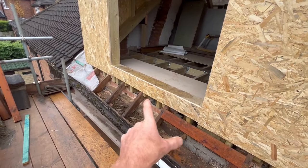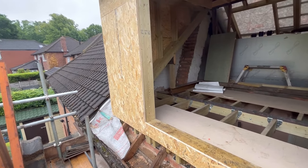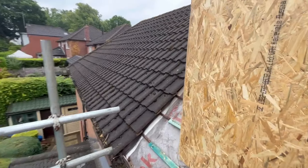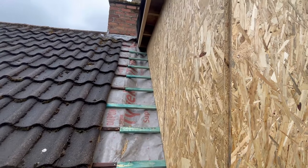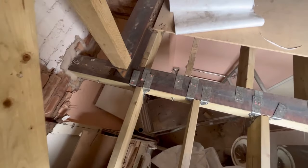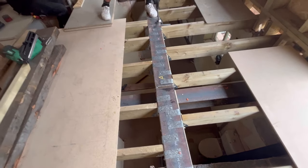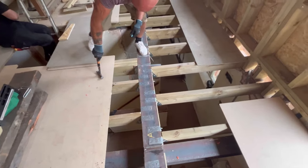It's a bit of a juliet balcony — I think they're going to have a cast iron one or a glazed one or whatever. So yeah, all done around there. We've just been through and metal-pinned all of the joist hangers all the way across. Some of them still have the orange sleeving on them but we're just knocking them up now so it's not too high.